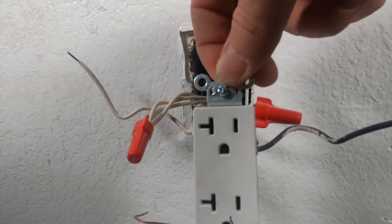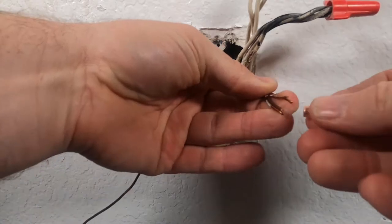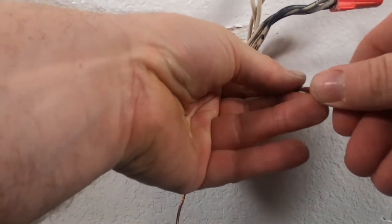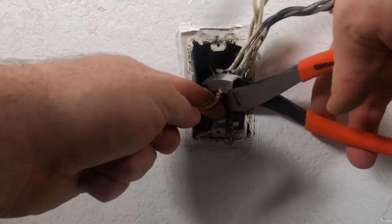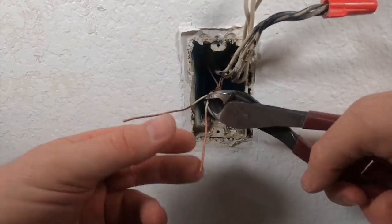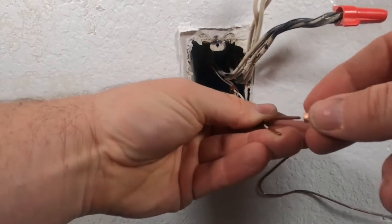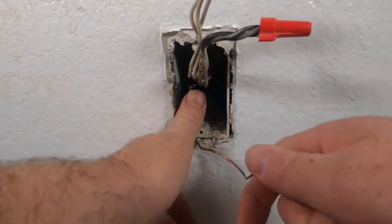In this situation we're gonna pull out the grounds as far as possible in the box. Then you're gonna want to put a sleeve right over it and make sure you guys get all those grounds into this sleeve right there. We're gonna go ahead and crimp this copper on here. I'm gonna go ahead and cut these off like so, I'm gonna leave this one and grab another crimp, put this thing on here just like so. Copper's done — shove that in the back like so.